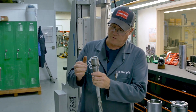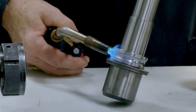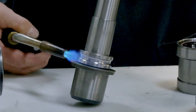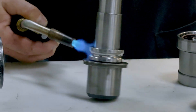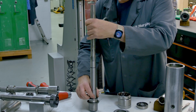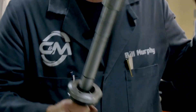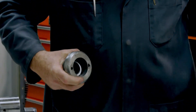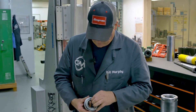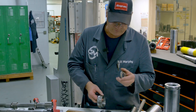This little dirt shield up here you're going to grind flat and parallel. This little piece of bearing we can warm up and take off. These pieces are going to get ground flat and parallel and cleaned up. They should have a little groove in here like this, standing up. This dirt washer — dirt shield, debris shield, whatever you want to call it — goes in here. Make sure it's flat and parallel within a tenth.